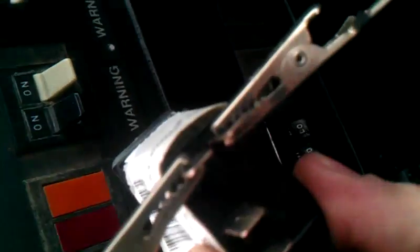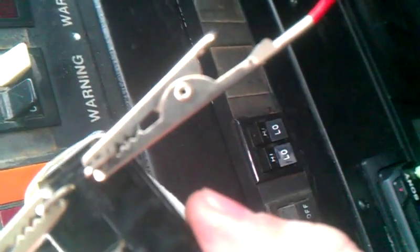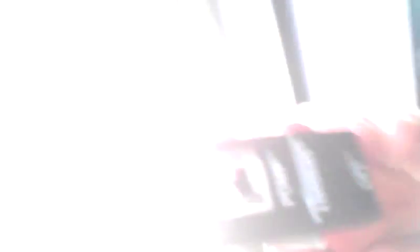Here's what we're going to do. You should be able to see just fine. Remember I said pins 7 and 8 on the switch control that LED. If you look, pin 8 is the left pin, and that's the black wire, and it's grounded. And pin 7 is the right pin. And as you can see, no light.